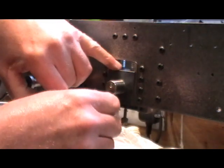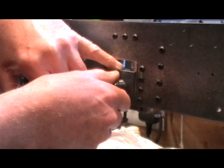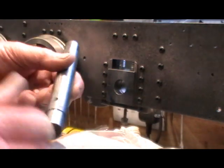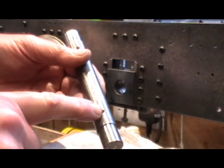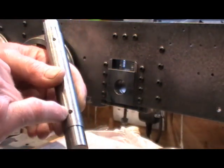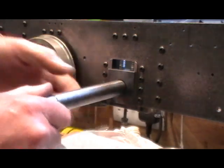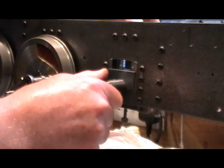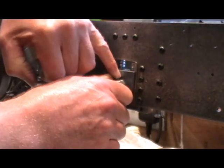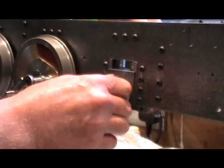The reason I'm telling you that is: when you've drilled your cross hole, it's dead in line with the groove in the center of the axle box, but the axle box has a tendency to move up to a 16th overall on that plane, so it's going to slightly go out of line. You may only get perhaps a third of the hole in the groove. So what I've done is countersunk each hole approximately twice the diameter of the hole, so the oil is still going to get to the axle box even if it's not quite in line.